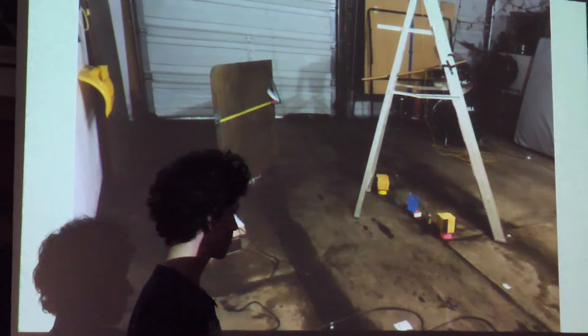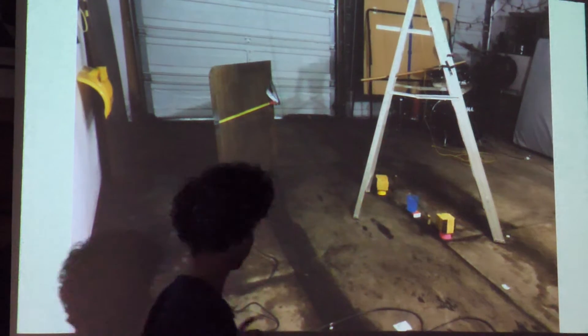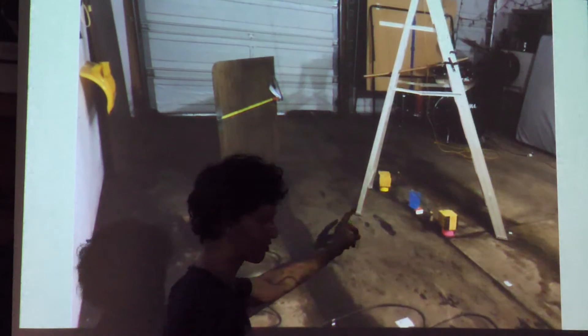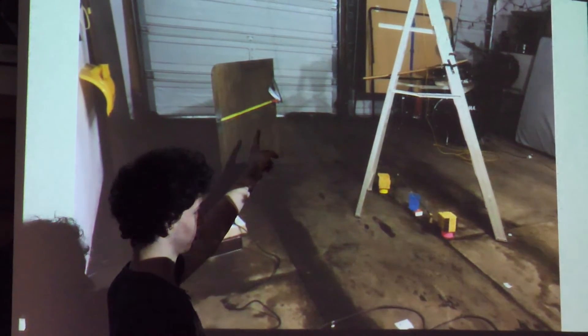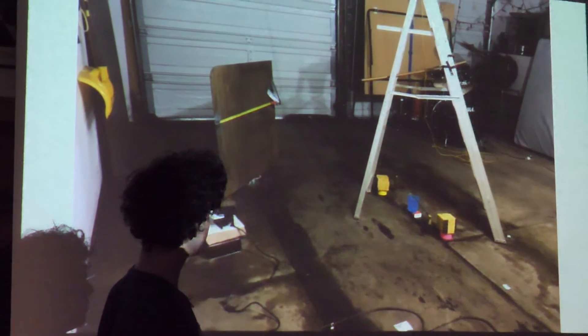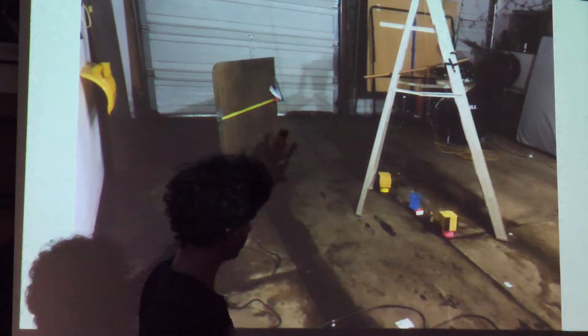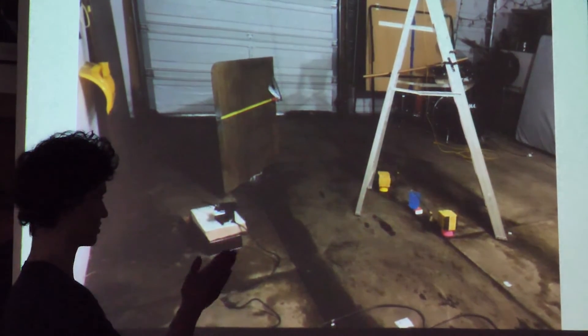In the middle of the rod is a little piece of mirror. This is important because we can shoot a laser at the mirror, and when the rod turns it moves the dot across a background we set up. If we know the distance the dot moves and the distance between the board and the mirror, we can use trigonometry to find out by how much the rod turned.